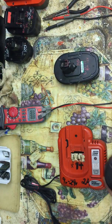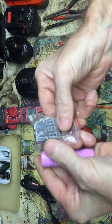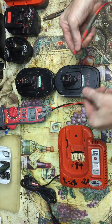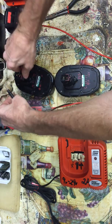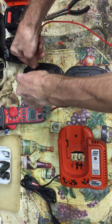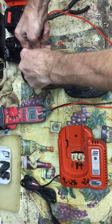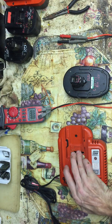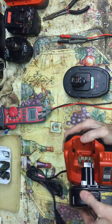That's just one battery. I've got 10 different things going on here, and the reason I have so many is I'm trying to use them up, save the cases, and then rebuild them with my lithium ions using my old setup. So that's the whole reckoning for this — I'm just trying to get every dying nickel I can out of these. This one was reading zero, but now it reads 9.66 volts — you can see that — so this one needs to go back on the charger.